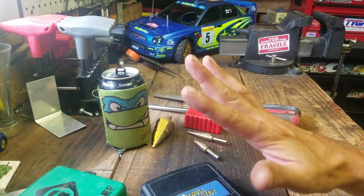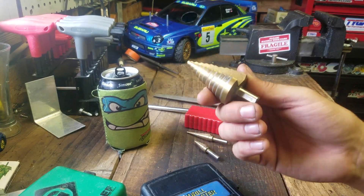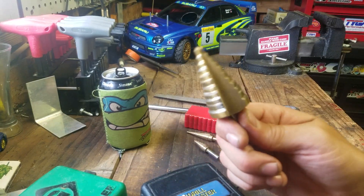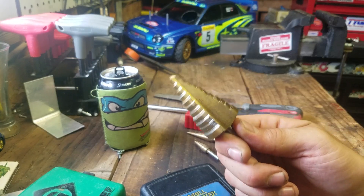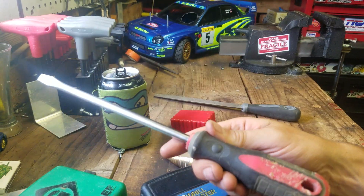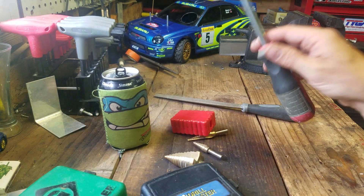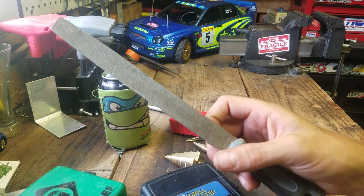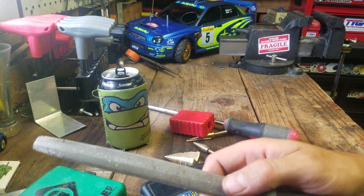So that's my top five and only five Harbor Freight tools for a commercial electrician. You got your step bits — I'll never buy a Greenlee, Klein, or Milwaukee one ever again, only Harbor Freight. Harbor Freight got wise to it too, because their sets used to be like $13 for this one and the half inch one; now they're like $20 because they're probably one of their best sellers. The tamper proof set, get yourself a big ass screwdriver — big flathead just to beat the shit out of things. It's only three bucks. And a file: all you're going to be doing is deburring pipes, just getting rid of the sharp edge that could possibly cut into the conductor.